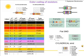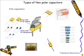The four-band scheme consists of four colored bands painted around the body of the resistor. The first two bands are the first two significant digits of the resistance value, the third is a multiplier, and the fourth is the tolerance. Each color corresponds to a certain number shown in the chart. The tolerance for a four-band resistor will be 2%, 5%, or 10%. If no band is present, it is understood as 20% tolerance, which is the least accurate.